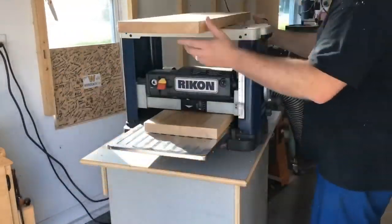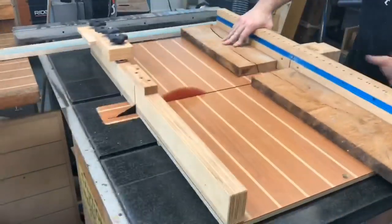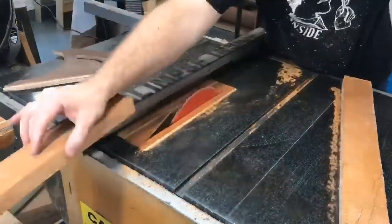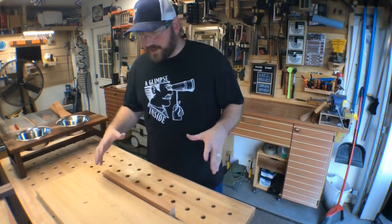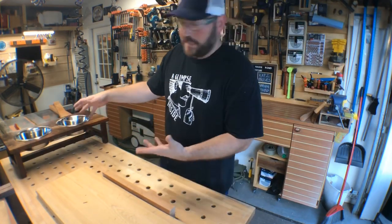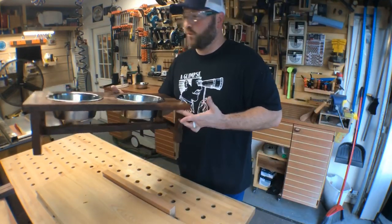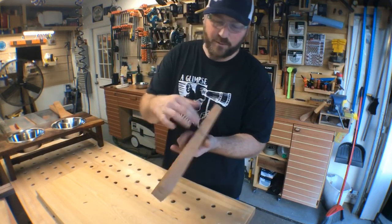The left and right sides of the board are perfectly flat but there's still a cup in the middle, so I'm continuing to send it through the surface planer taking off about a 32nd or a 16th of an inch at a time. I'll also take this mahogany with all kinds of checks and imperfections and cut it down on the table saw. I made a previous dog bowl set for a client - the walnut looked great - but I'm not really liking the color of this mystery wood.